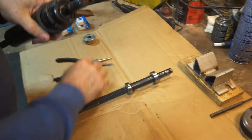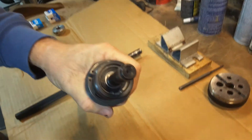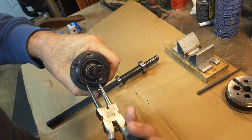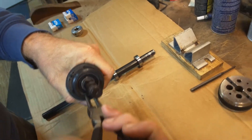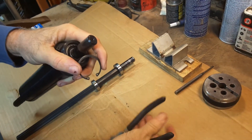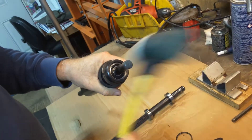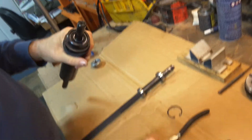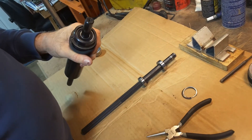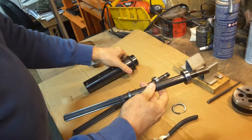Underneath is the snap ring. It might have a lot of dust so you might have to blow it out or vacuum it off to find the little holes for the snap ring. Just squeeze — there's the snap ring. Underneath there could be a little spacer like this; a lot of quills have this thin shim spacer. Then you can use the mallet to knock the shaft out.